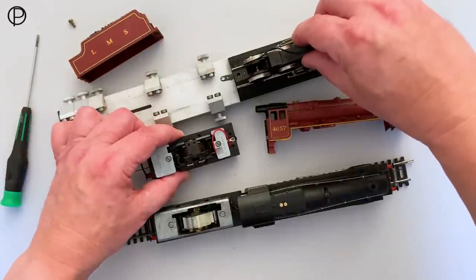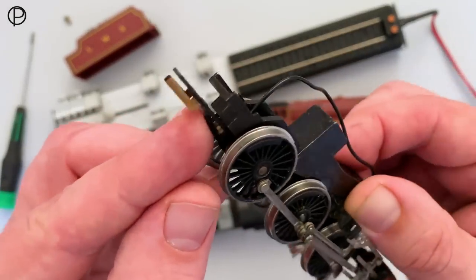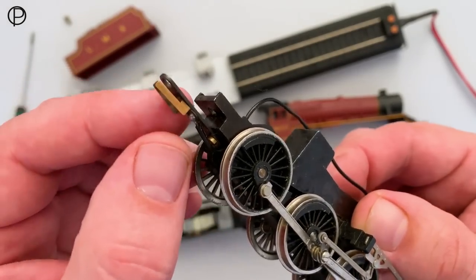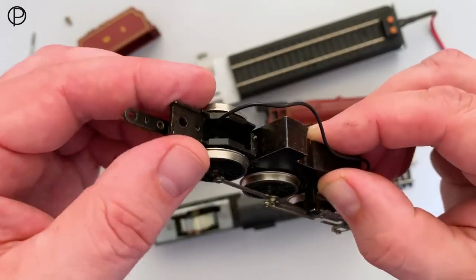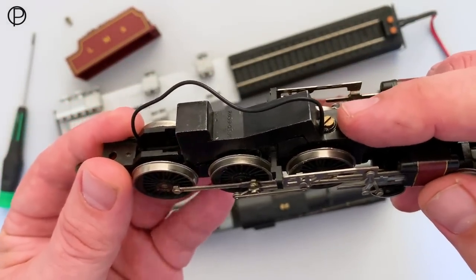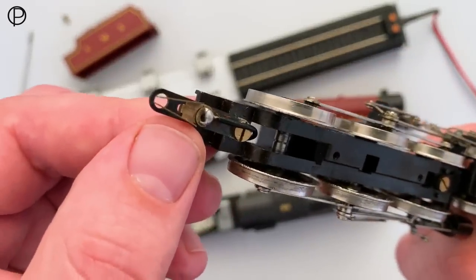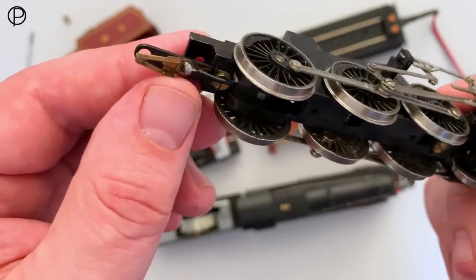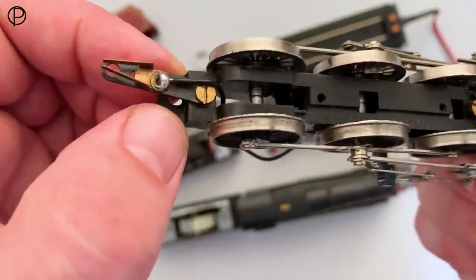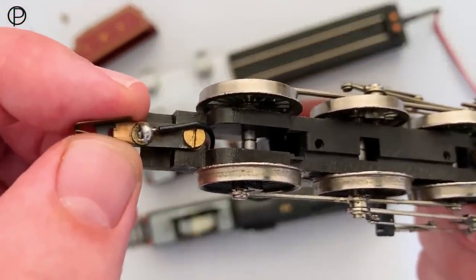It just drops. That pin we just looked at there just drops into that hole there and makes contact with those two metal contacts, sprung contacts either side. And I think somebody's not cross-wired it, but reinforced the connection by taking it straight from a screw holding the chassis together and soldering it straight to the copper alloy type strip, whatever type of metal that is. Because I think really the weak point is this screw and where it holds the drawbar in.